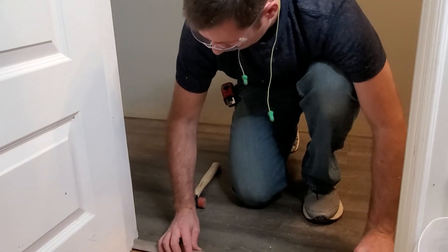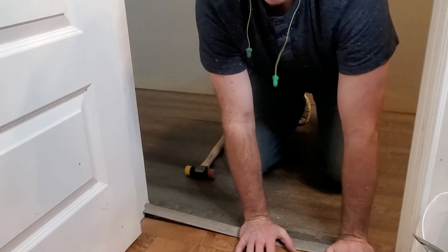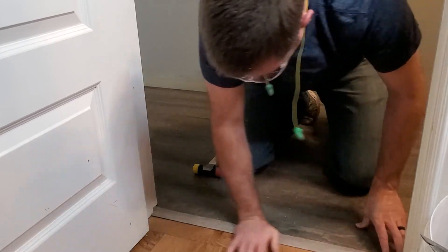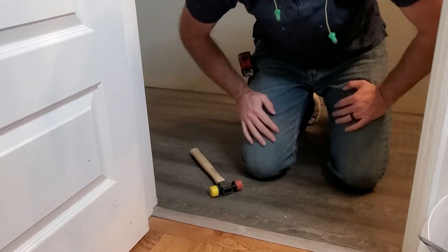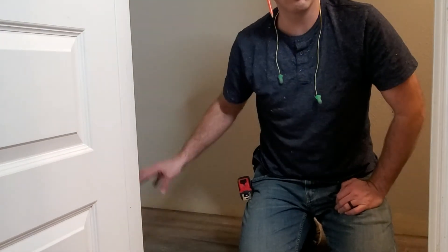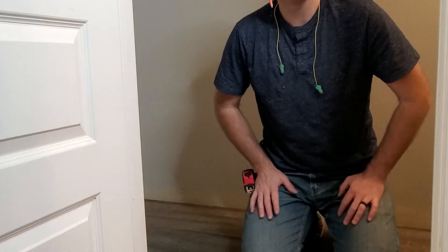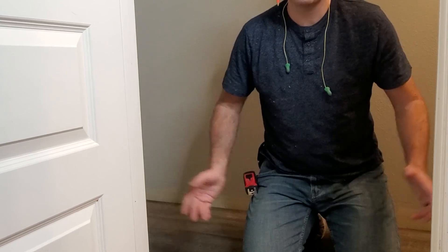This should just push right in now once it's in the right spot — just like you're at a chiropractor and you're the chiropractor. Tap it a little bit if you want. There we go — we've finished the bathroom. Bathrooms often take longer than other rooms because you have penetrations coming through the floor and it's such a small space that you're making cuts on almost every other board. In bigger rooms you can run longer spans and the project goes faster. So if you can tackle a bathroom, you can tackle anything. Thanks for watching — remember to like and subscribe and turn on notifications for more great content.